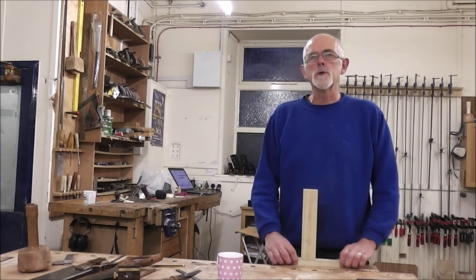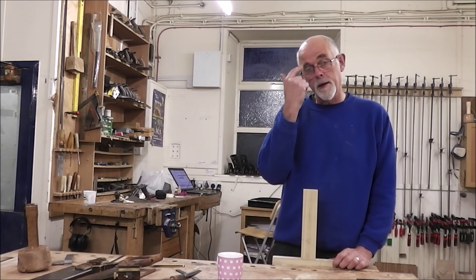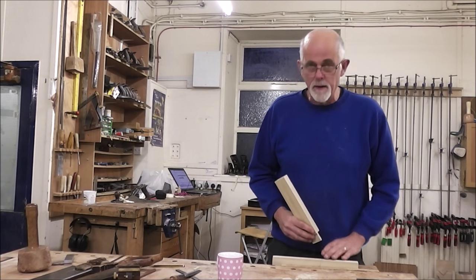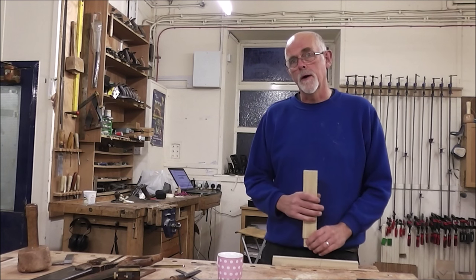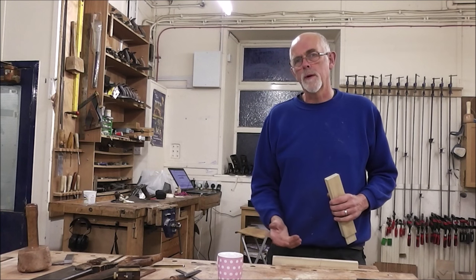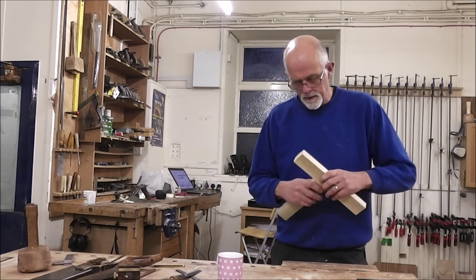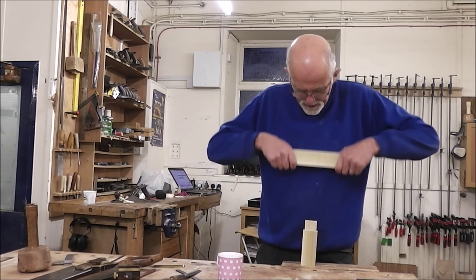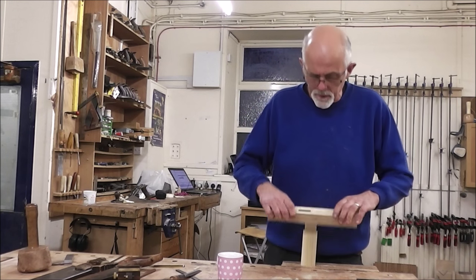I just wanted to have a quick word about the dangers of mortise and tenons — specifically in relationship to 'tenonitis'. Tenonitis is characterised by bruising of the forehead and black eyes, and it comes about from people trying to pull joints apart like that — it suddenly comes apart and you go bang into the forehead. I've had a number of students who have suffered from it and I've suffered it myself in the past. The trick is to turn the joint this way up and pull it apart at right angles to the joint rather than wobbling it like that, which would create wear on the joint and loosen it. So pull it apart at right angles.